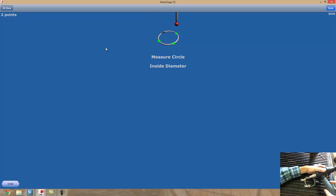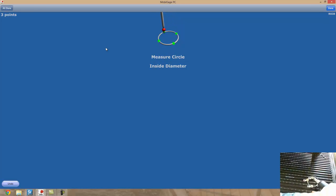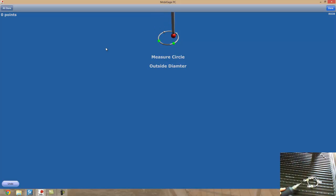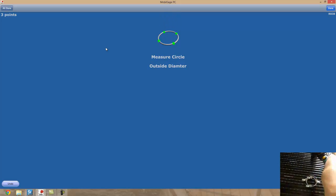Another 4 points for my inner diameter. The two circles I'm going to take in this measurement are actually going to be projected onto that top plane so that they are concentric circles and I can determine the width between the two. So instead of taking a pair of calipers to it, I'm essentially getting these 2D measurements — projections of these diameters — and just getting the measurement that way. I'll take one more point.